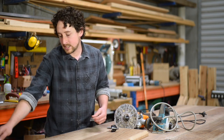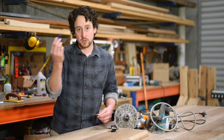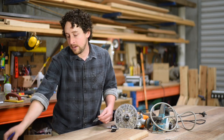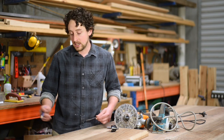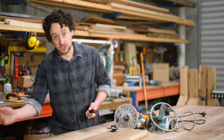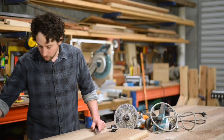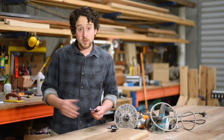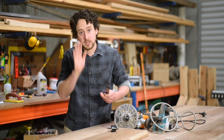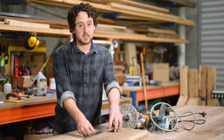So on my board here, I can see these black fissure lines or crack lines and they're really nice indications of which way this grain is going. I'm just going to draw them in with a blue pencil so you can see them a little bit more easily. If you don't have these cracks, what you're looking for is these big loops or whorls in the timber. I'll draw them on as well so you can see how that relates to the way the grain will be interacting with this edge. Overall, you can also see that these black fissure lines or cracks are moving in this direction towards the edge, so I know that I've got a whole bunch of fibres pointing out towards me. If I ran my hand along this way, I'd be more likely to get splinters than going the other way. You can consider the splinter thing to be exactly the same when using a router bit.